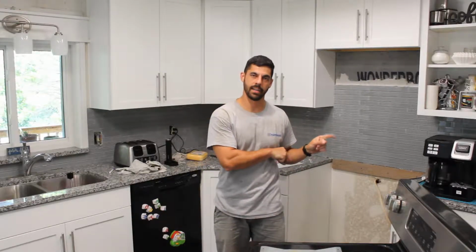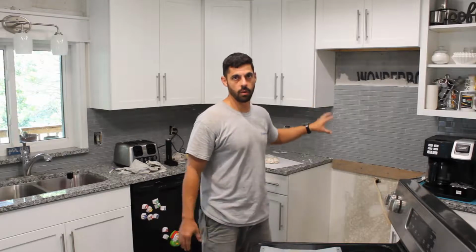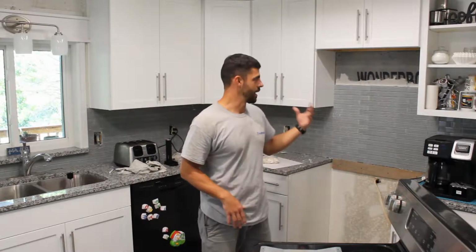So today was the first day of school, which means last night, kids to bed early, meet the teacher, all that good stuff. So we didn't have the opportunity to come in after 24 hours and do our grout work. So the mastic and tile has had 24 additional hours, a total of 48 hours, to cure on the wall. So I think right now is going to be a great time to mix up some grout and get this spread out on those tiles.